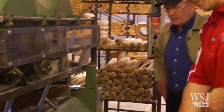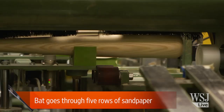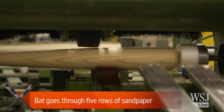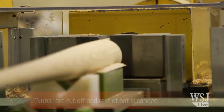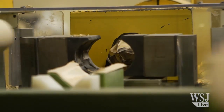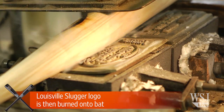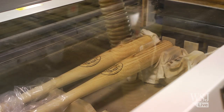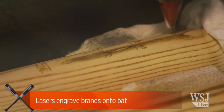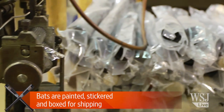After a bat's turned, it's taken over to combination where we start the sanding process. You put it in the sander and it goes through five different rows of sandpaper, comes out the backside where the worker cuts off the nubs, the ends are sanded smooth, and then on another machine we cup the bat if required. Next, all bats go through a filler process. They're brought back to be pad printed — that's where the oval is put on the center of the bat. When bats are out of the finish area, they come to our laser engraving area where the front and back brands are put on. They are then paint-filled, stickered, boxed, and ready to ship out.